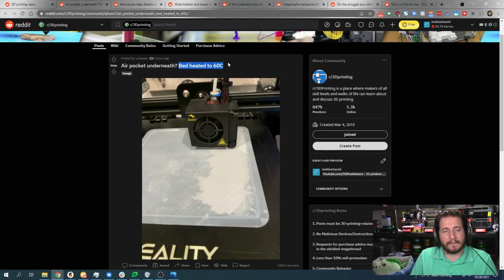But interestingly, the fact they're saying that the heated bed is at 60°C does not really help us out all that much. Knowing the material, this is probably PLA, it's an Ender, it's probably PLA, but also knowing the extrusion temperature. If you extrude too cold, PLA will peel. If you extrude too hot, it can burn. But it looks like extrusion temperature-wise, we're right where we need to be. This one can plague you for a little bit, definitely a trap for young gamers, but real simple, clean that bed, re-level it, get her printing one more time, and you've got this in the bag.